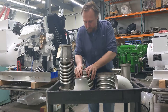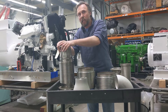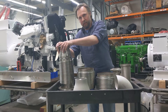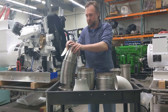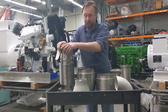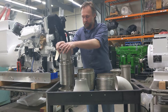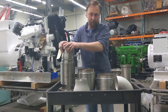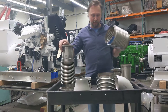The other advantage of a multi-ply flex section is they have quite a bit more flex. They're more of a slinky than the old school single-ply stuff that was kind of the Navy spec that came from World War II. Most of that stuff was 35 thousandths of an inch thick, so over a 32nd of an inch — that stuff's not very flexible. The rule of thumb is that the flex capsule itself had to be 12 times the diameter in length to actually get the amount of compression you needed. This stuff can be considerably shorter.